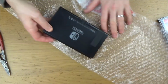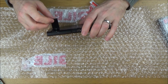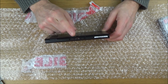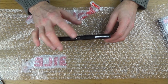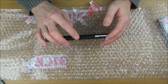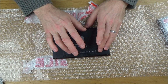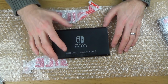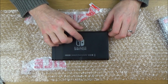Right, okay, so here we have this one. Let me tell you a little bit about what we have here. Basically, with this one, apparently the charge port has been changed out, but I think there was a bit of corrosion or something, and it was a little bit tricky to do, and I believe 3 of the pads have been ripped off. Now, the guy who sold it to me, his name's Gary, thinks that the 3 pads that are ripped off are just ground pads, so hopefully they're not too important, but it's still not working. So he thinks it's the actual charge chip in here.